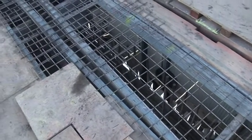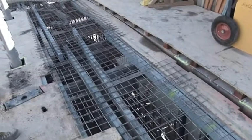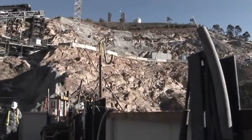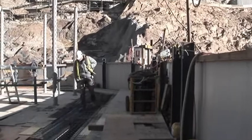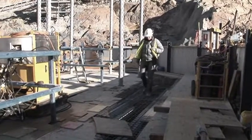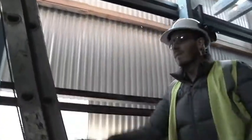We also use the top deck for the hydraulic unit that operates the rams for the jacking columns. You can see the penetrations in the deck with mesh over the top — that's where reinforcement is passed down to the workers below on the platforms doing the formwork and putting the reinforcement into position. We also use it to put in the water stop, lower in materials, and do our survey and checks.